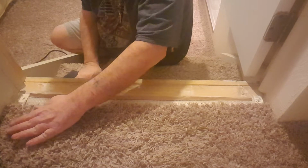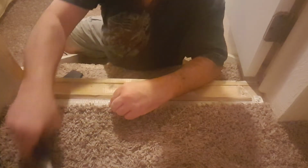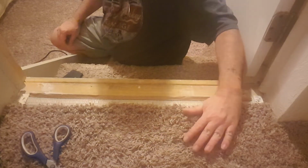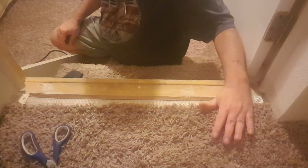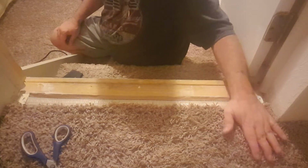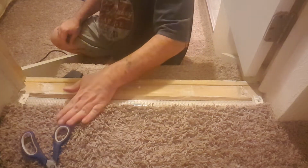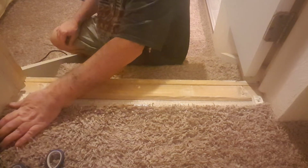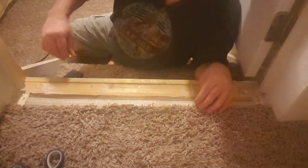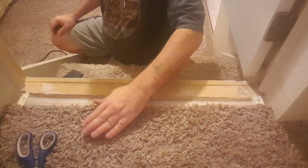And then we'll start fluffing this carpet back again. And once we get it all fluffed back, and if you got rogue ones, you can just cut them off. Or I do, at least. I don't know if that's correct or not, but it's what I do. Making sure that my tape stays clean. Or my glue strip, I guess it's called. I'm just brushing it back the opposite way until it stays. And that gives me a nice, good straight line for my other to fit into. And I think we're there. So now I see I got one piece of this right here. There we go, I cut it off. That's the clear fibers that's in there. I think it's part of the backing.